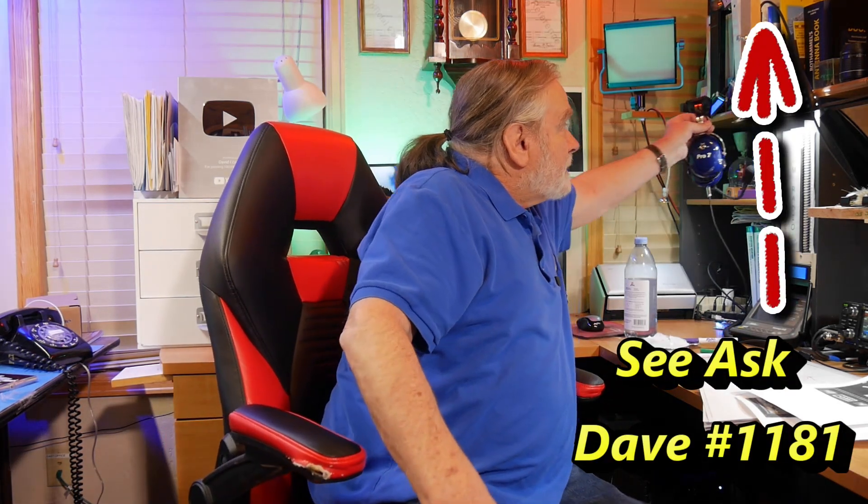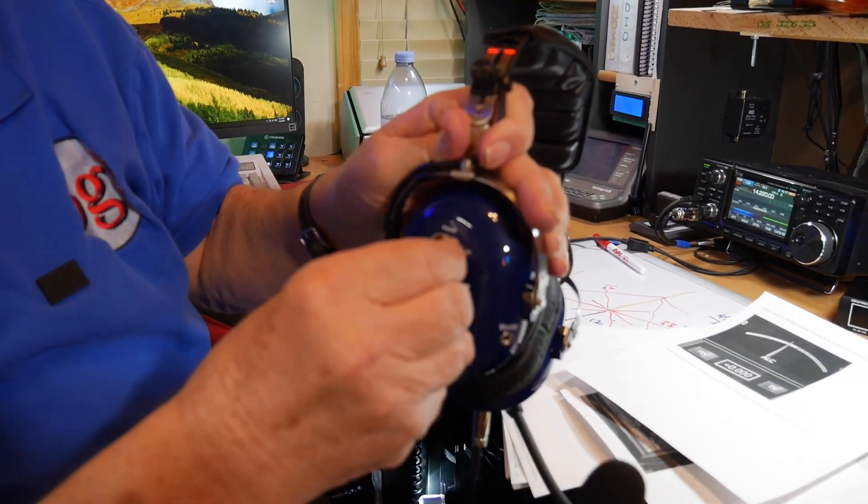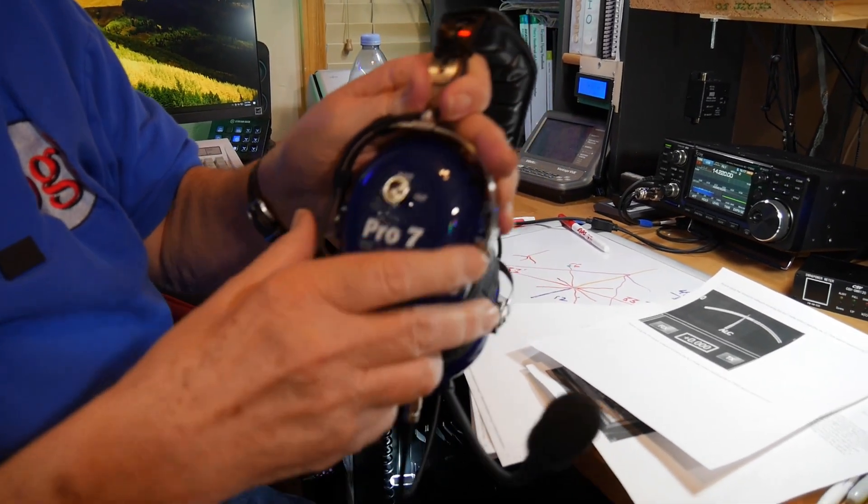If it is a phase shifted mode and you start putting compression in, you are definitely messing with the phase shifting. The human ear is not that sensitive to phase shifts — though if you are a trained musician, you would likely disagree; you can tell the phase shift immediately. This headset has a little switch on the side about phase — whether the phase is in phase between the two sides or opposite. If you put it in phase, each side gives you the same signal and you hear it in the center of your head. If you take it out of phase, it flips the phase on one side, making the signal seem to spread out more inside your brain. I find it easier to listen that way, so I've always got mine on the phase reversed.